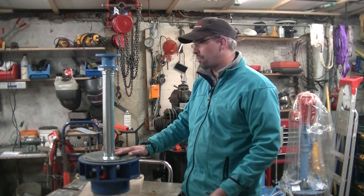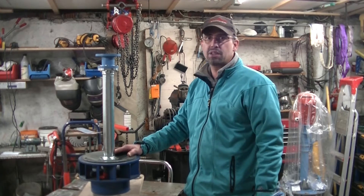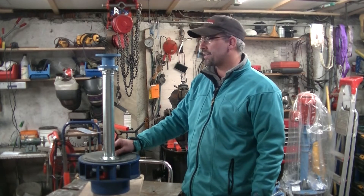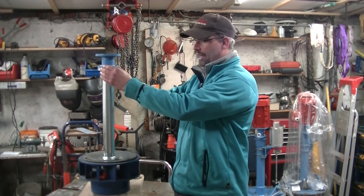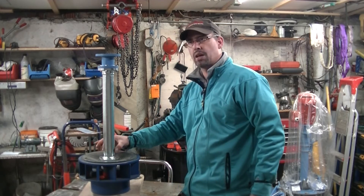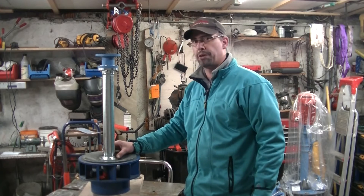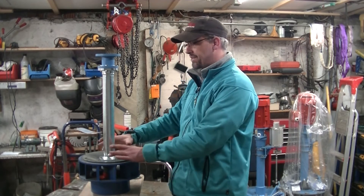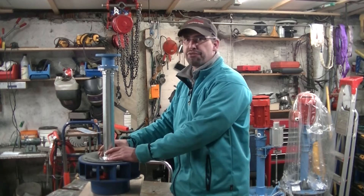The new improvement on this turbine — if you look at low head turbines on the world market, you see there are many manufacturers sitting in Vietnam or China. These turbines normally have the main bearings of the turbine shaft on the top in the dry, and the shaft goes down to the propeller. At the bottom of the shaft is a water-greased bearing, and below that is the propeller. The problem is that if you have any imbalance on the propeller, you get high friction on the water-greased bearing and have to change it very often, depending on the water quality.